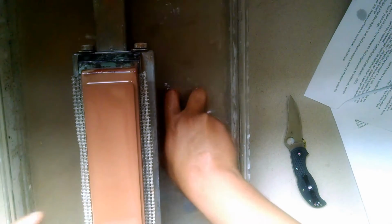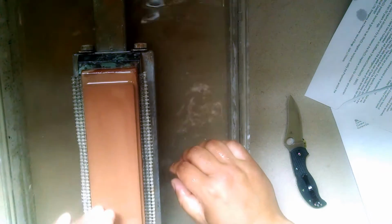I've got my 1K. Let me go ahead and prep my stone. You always want to make sure that you flatten your stones before you use them. Sometimes people use a ruler or whatnot to check and make sure that they're nice and flat. Sharpen off the edges as well, and make sure that those aren't touching your edge. Just part of the stone maintenance. If they hollow out too much, you just won't get the results that you're probably looking for when you're sharpening. So let's get to it.